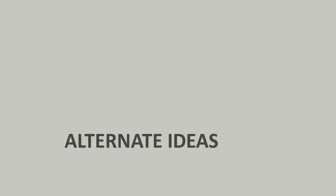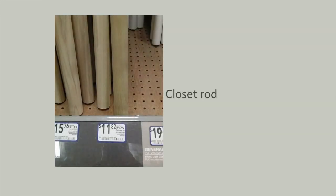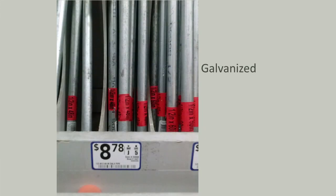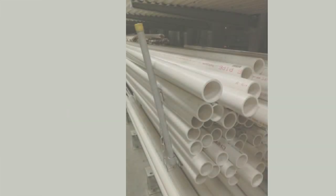You've seen the way I did it, but there are many changes you can make to the design and the materials used. I chose round aluminum tubing because I think it looks better. However, round tubing is not available in four-foot lengths from your local big-box store, so you may want to use what is available locally. You could also use closet rod or thick dowels and paint them — of course you'd have to prevent the ends from splitting by reinforcing with cross bolts or by wrapping them in metal in some way. My original thought was to use galvanized pipe, but it was too heavy. You might even want to try electrical conduit, though it seems pretty thin. PVC is too flexible in the smaller sizes or too bulky and heavy in the bigger sizes.